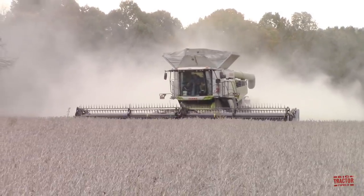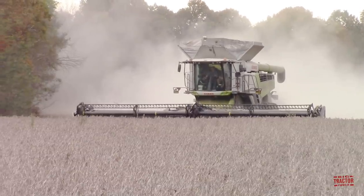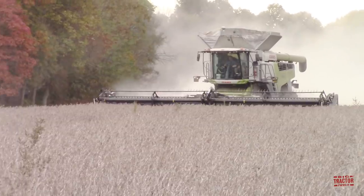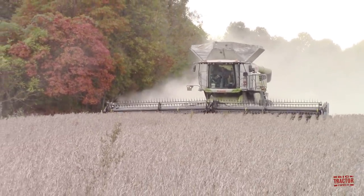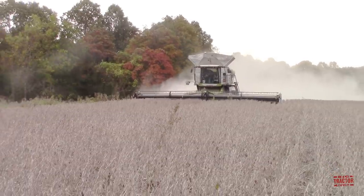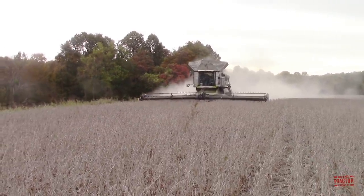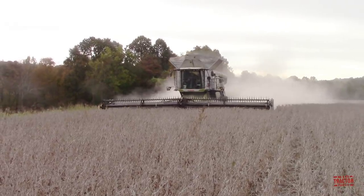a big Class 8 CLAAS Lexion 8600 TerraTrac combine, powered by a 12.8 liter MAN D26 diesel engine rated at 483 horsepower, is harvesting the crop. This machine has a capacity of 510 bushels and is harvesting the soybeans with a 40-foot wide MacDon FD70 Draper Head. This brand new model year 2020 CLAAS Lexion combine has just rolled off the assembly line in Omaha,